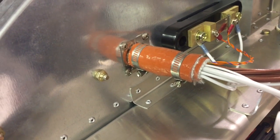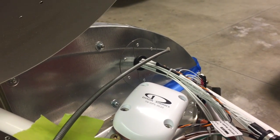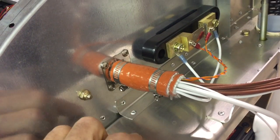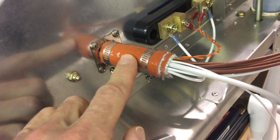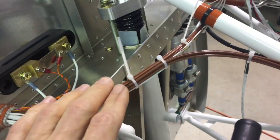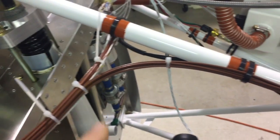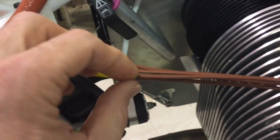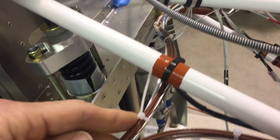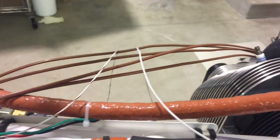Here's where most of the wires exit the firewall. There are a bunch of wires over here that mostly go to the engine ECU, which I'll show in just a minute. I bought one of these stainless steel firewall exit kits — it comes with the exit part, fire sleeve, and hose clamps. Once it's all done I'll probably put red RTV on here to seal it up. The brown wires you see here are for the EGTs and CHTs — four of them split off and come up here, and the other four come across on this side and will go to those cylinders. These are all Dynon, and you can see how nicely they're marked.